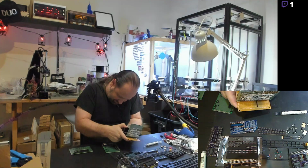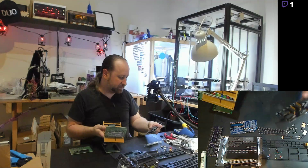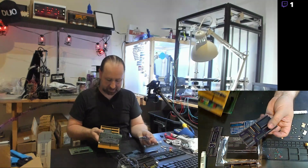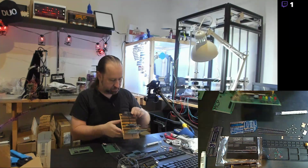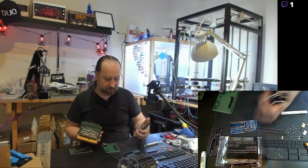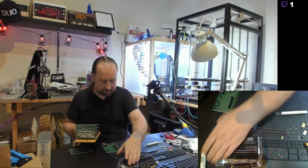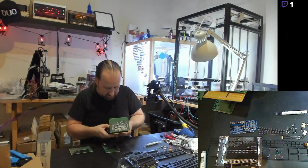Yeah, so there's that. Anyways, this is actually a 512K RAM ROM, so you can access 512K of RAM on an 8-bit system, which is quite a bit. And let's see if I can squeeze that in. There's also a serial port card, a timer card. There's a whole bunch of system options, and you plug all these cards in and upload a firmware to the ROM, and you get a nice full working 8-bit system with all sorts of freaking cool options.